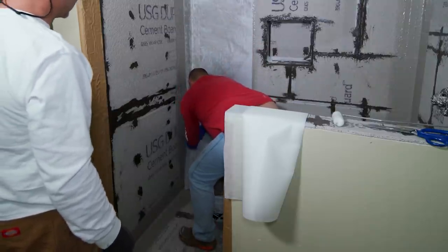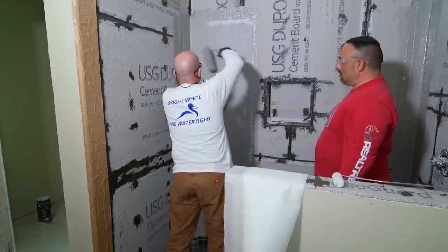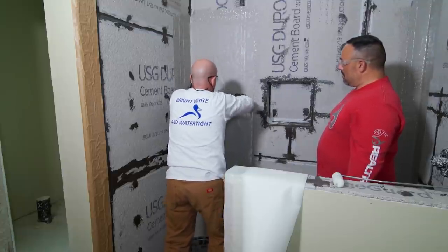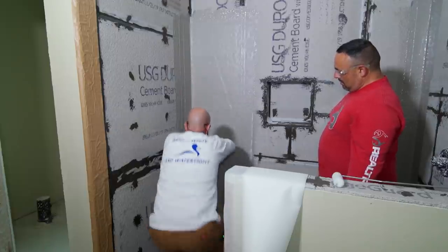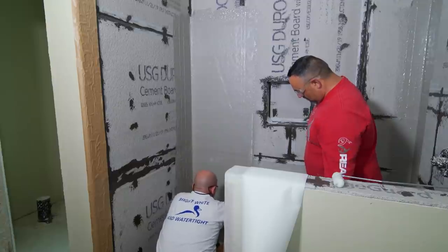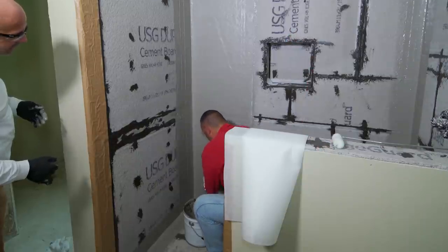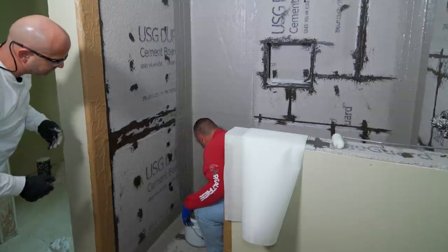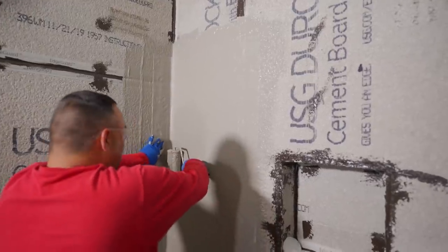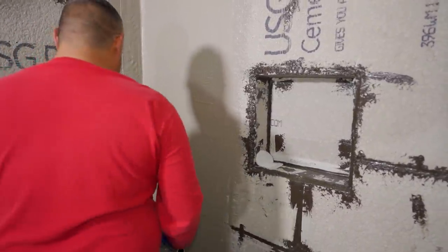Everything's starting to turn gray — that means you've got your liquid up underneath there. You're going to start moving stuff around as you add more pressure — I just hold it kind of in place. All I'm doing is flattening those wrinkles out, making sure that bottom soaks up into it nicely and quickly. See how it starts pulling straighter? Now work on your 90-degree at the bottom. Once you have those wrinkles out and you have good saturation, go ahead and wet that roller down, get it nice and wet, and start saturating while you're straightening it up. Just enough pressure where the fleece doesn't slide around on you. Make sure you go from what you're doing and push to the outside in case you've got air that you're shoving out.